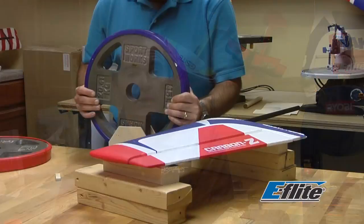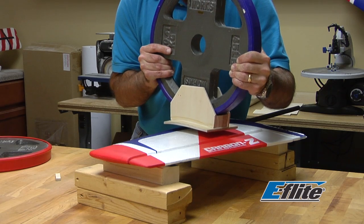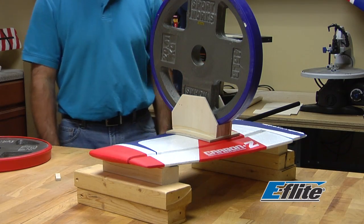Just for fun, we said how much more can we go? The only thing we had around was 45 pounds — a similar weight shape. We put 45 pounds on the wing and the wing was still handling pretty well. We kept it there for a few seconds, took the weight out, looked at the wing and the trailing edge, and it was pretty straight. So we didn't go further — 45 pounds is what we have. But as I said, it's an extreme test, and probably other things will fail before that happens.